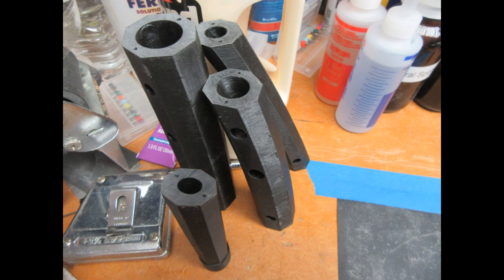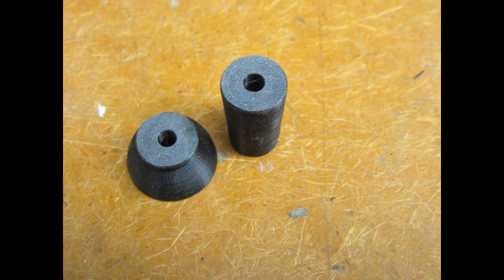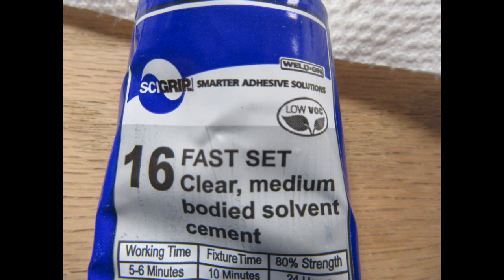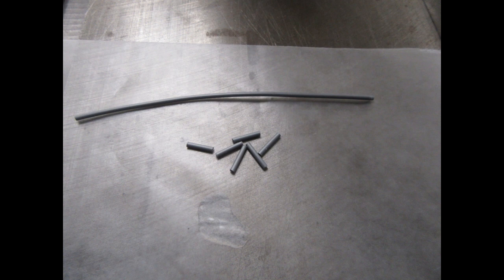Here all four of the main parts are prepared. The mouthpiece sections are already prepared, although they do not have alignment holes. Here's my setup on top of my table saw: a piece of wax paper, all the sections that are going to get joined, a couple of nitrile gloves, and a tube of Weldon No. 16 cement, which is appropriate for the PLA material I've used to print these pieces.